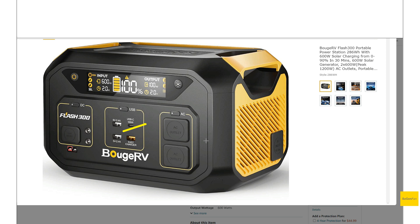So if the 600-watt input wasn't enough, there's also a 100-watt USB-C input. The reason I love having a USB-C PD input is that you can trickle charge this unit if you want to use it for pass-through charging. This unit doesn't have a UPS — not too surprising on a smaller unit with all these other features. You can just have a little bit of power coming in through the USB-C while outputting on the AC side. You don't want to be doing a 600-watt fast charge while outputting, as that kind of pass-through charging will degrade the battery really quickly.